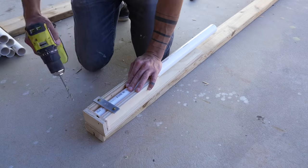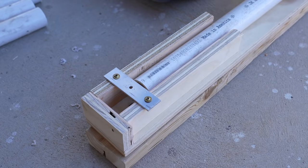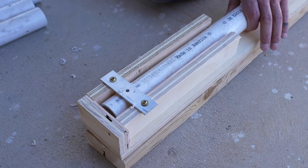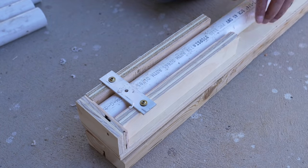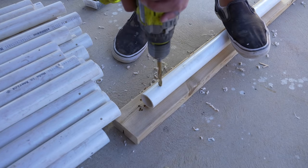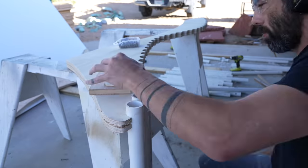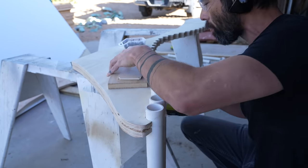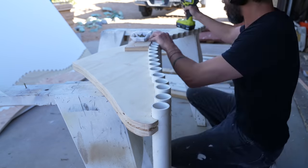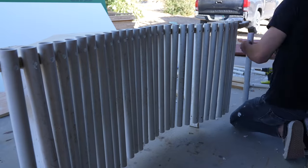I'm going to need some holes on the ends of the PVC pipe so I can screw through them and into the plywood side panels. So I made a handy little jig out of scrap pieces of plywood and a small piece of aluminum. I drilled all the way through the pipe, then switched to a larger drill bit and drilled a larger hole on just the top side. This allows me to use a pan head screw, with the larger hole serving as an access point. I then stacked some scrap pieces of wood as a depth guide and started screwing the PVC pipe onto the plywood panels.